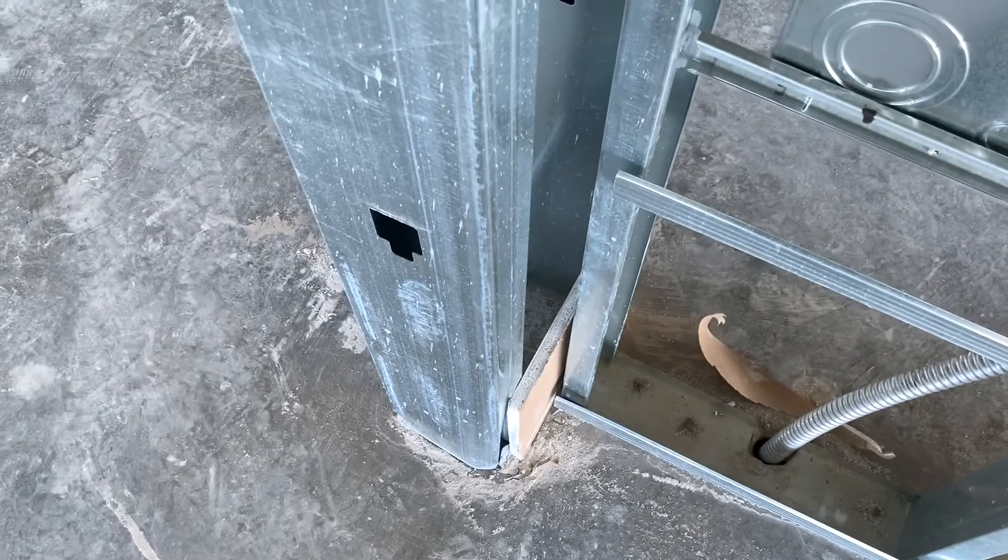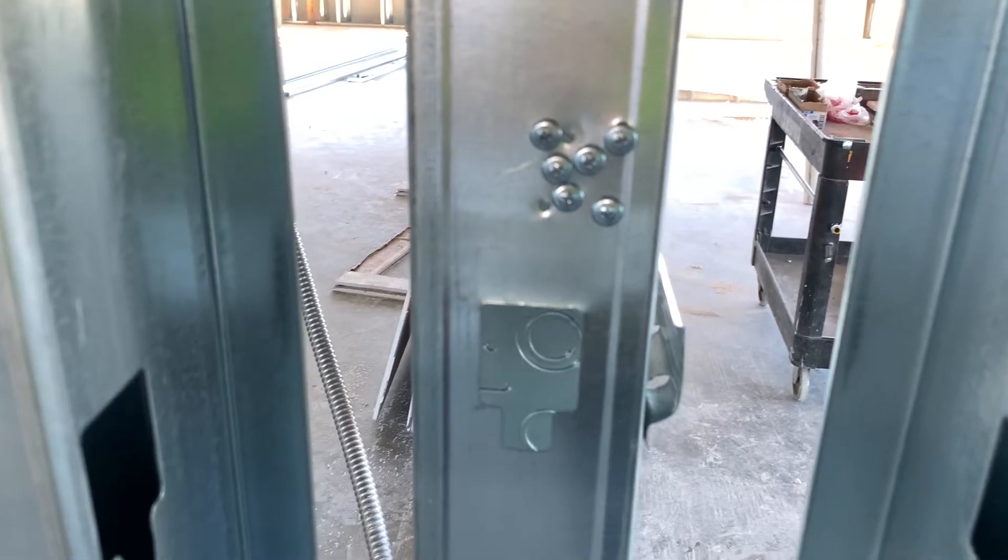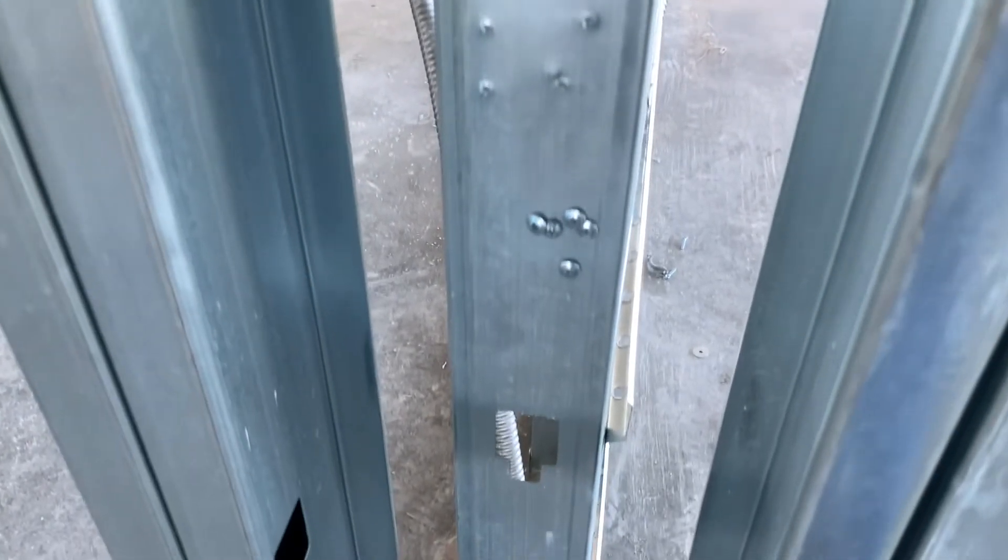Fixing other people's problems is never fun. Also had to re-screw the panels from the other side with the screws facing the hallway because of the sheetrocking, so the screws had to face backwards — also annoying. We'll get it done. Had to move the panels down four inches because the top breaker has to be at no more than 48 inches due to handicap ADA specifications. The panels are upside down on the sixth floor because they're bottom fed — so they just measured wrong. Thanks for watching, drop a like and subscribe, see you tomorrow. God bless.